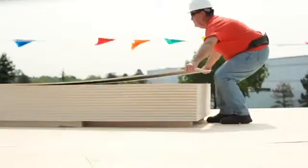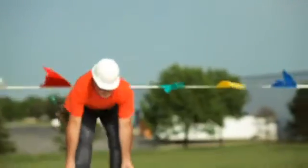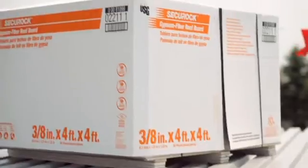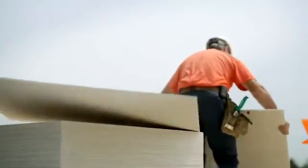With all the panels stacked face up, it's easy to remove SecureRock Gypsum Fiber Roof Board from the unit using a process called drag and drop — simply slide the board off the stack and let it land flat, keeping hold of the edge, then drag it to where you want it and let it drop. Because there's no fiberglass facer, there's no itchiness or irritation when handling. If you need to carry the board, be sure to hold it in an upright position, as holding panels incorrectly can result in breakage. For ease of handling, SecureRock Gypsum Fiber Roof Board also comes in a four-foot by four-foot size.